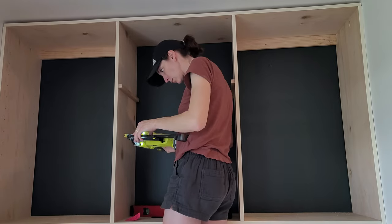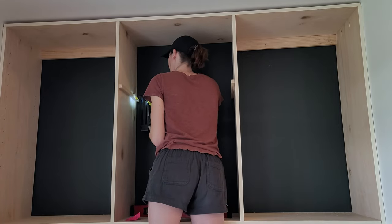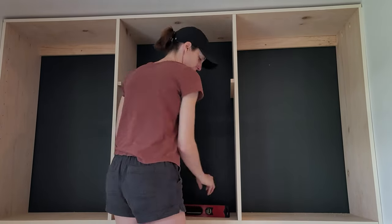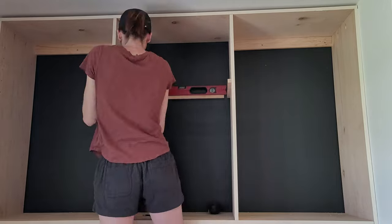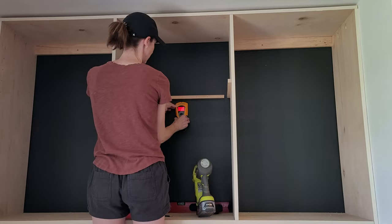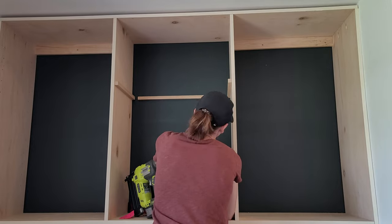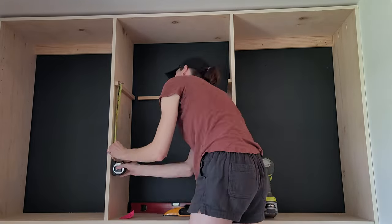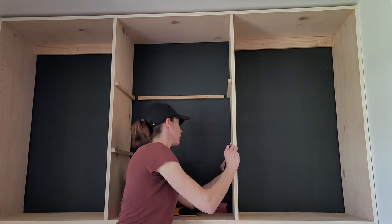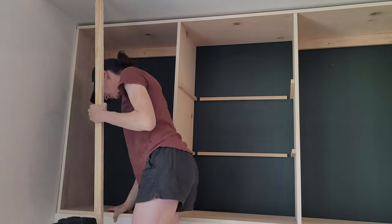These dowels will be painted green — the whole cabinet will be painted green like the back of the wall — but my shelving is all stained the nice farmhouse wood color, so I have a little variation and contrast. If you are adding support brackets for little shelves, I highly recommend doing the left and right brackets first; it just makes that wall bracket super easy to do. Then use your stud finder so you can make sure to get your brad nails into the studs for extra strength and security.